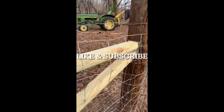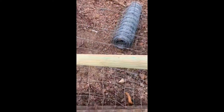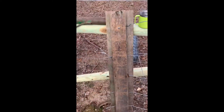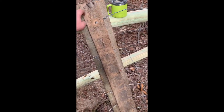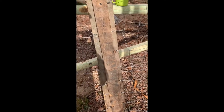I want to show you how to make a loop on the end of your fence for whenever you're stretching it so that it doesn't jerk out. I've got a fence stretcher — it can be a bolt one or one like this. I've just taken some little boards, this is from a pallet, and that's just a piece of scrap, and I put a bolt through. You can put it on here and stretch it and get your fence tight before you tack it up.